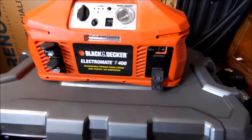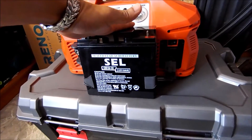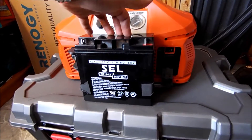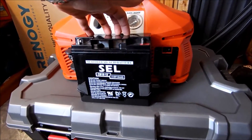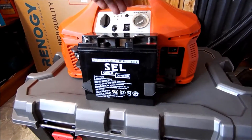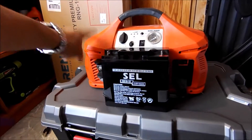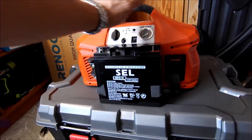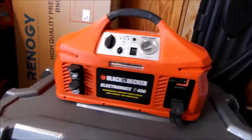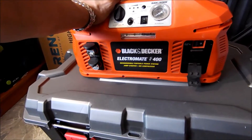I was going to just replace this battery. This is a battery designed for jumping applications — it's designed to charge slowly and discharge quickly. For solar you want the opposite. The direct replacement was $79 and if I remember right this unit was $100, so I wasn't about to just do that. I'd buy a whole new jump box in that situation. And this is not going to be my permanent inverter anyway — this is just to get the project going.